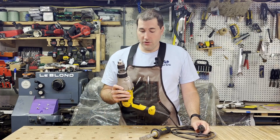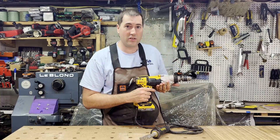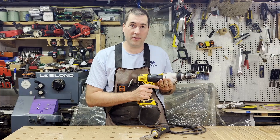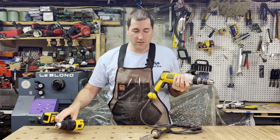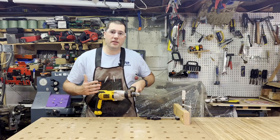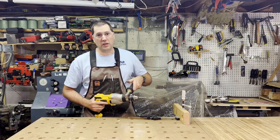One thing I'll note is that it's quite heavy and quite large. Comparing it to a new modern DeWalt cordless drill, you can see just how much smaller the cordless one is, and it puts out almost as much torque. So if you're trying to get into tight places, this corded drill isn't going to work for you. I've got an inch and a half spade bit chucked up here. One benefit of this drill is that it spins really fast — about 3,500 RPMs. Most cordless tools do about half that, around 1,650 to 1,800 RPMs. That really fast speed is going to make it cut a lot better.